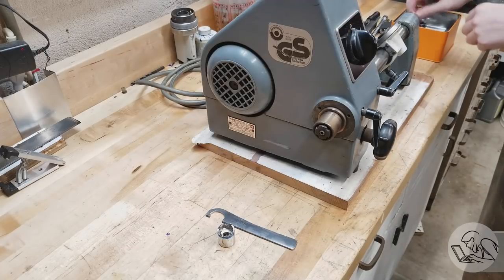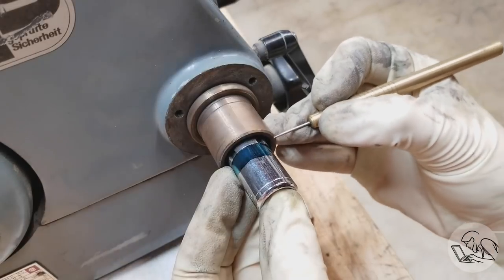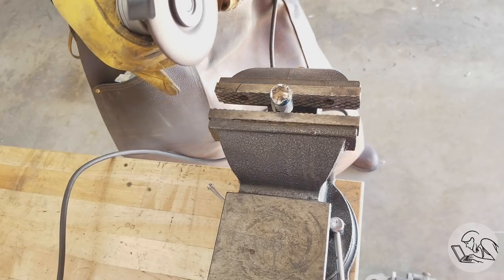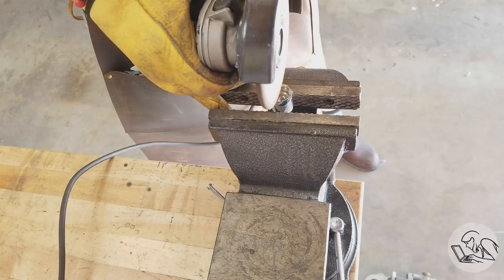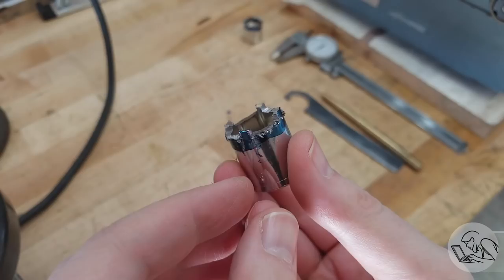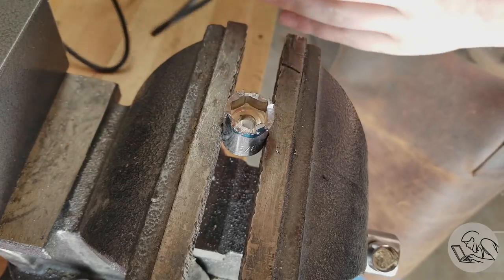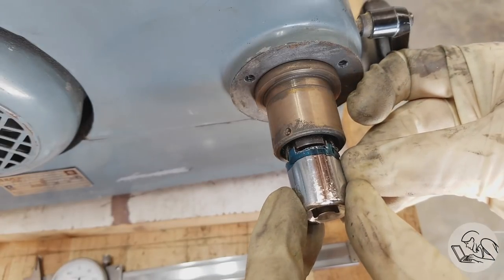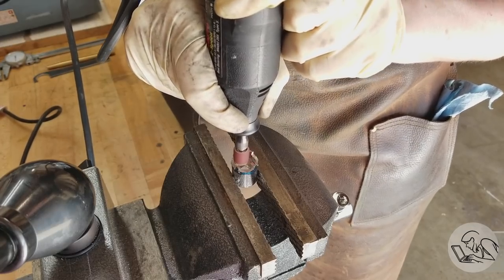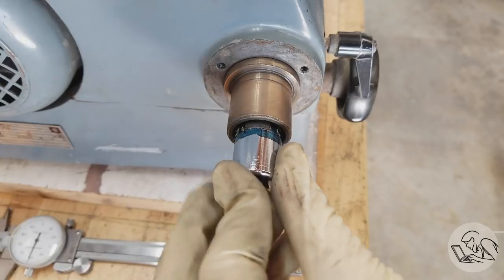I guess we've got to make another one. So I go back to the Chinese socket junk box and pick out another one. This is the same process as before to make a custom socket: I mark out where the teeth need to be, take out the bulk of the material with the angle grinder, square up the edges on each tooth with a cutoff disc, and that gives us the rough shape. Then I go in and refine that shape with the Dremel tool. The teeth are the right size but it still won't go on because of their thickness, so I go on the inside with a sanding disc on the Dremel to make the teeth thinner. Now it fits very nicely.